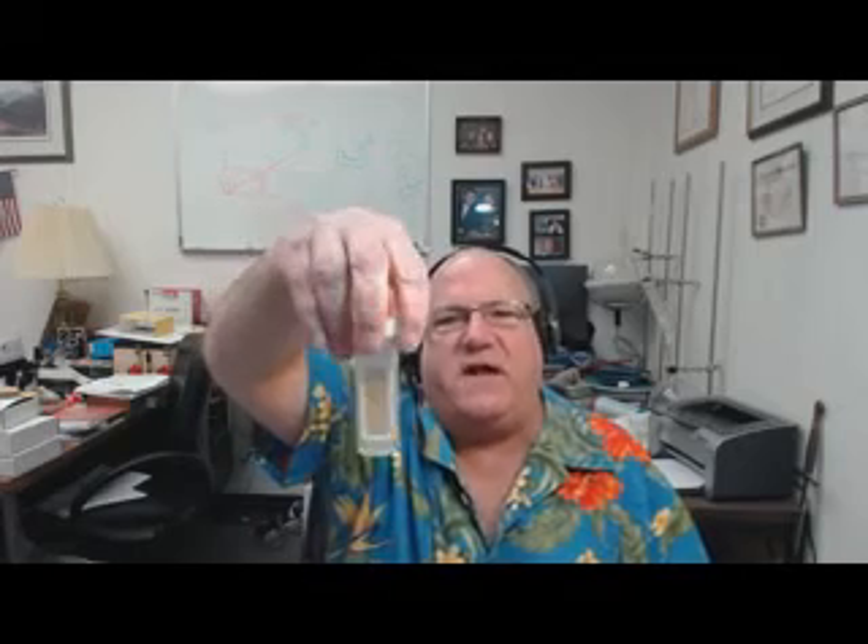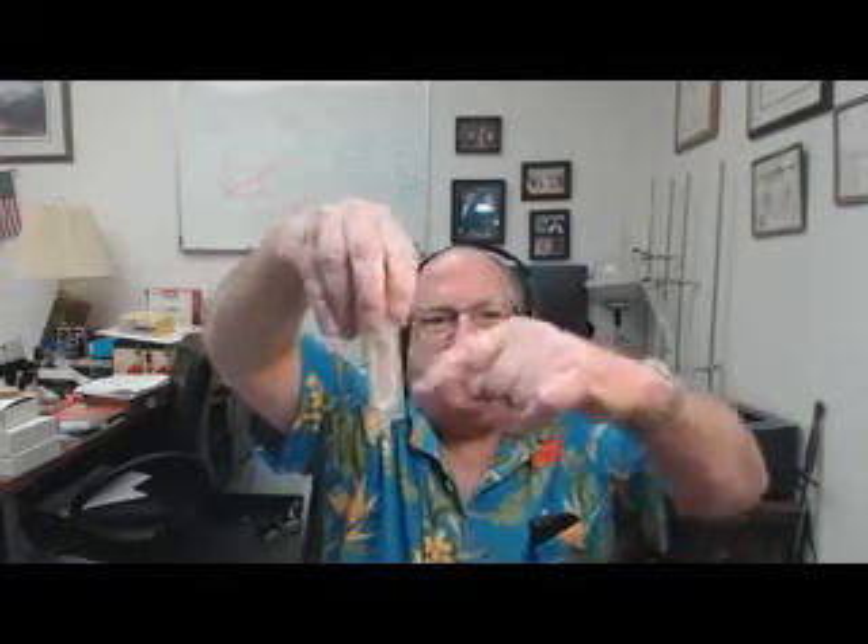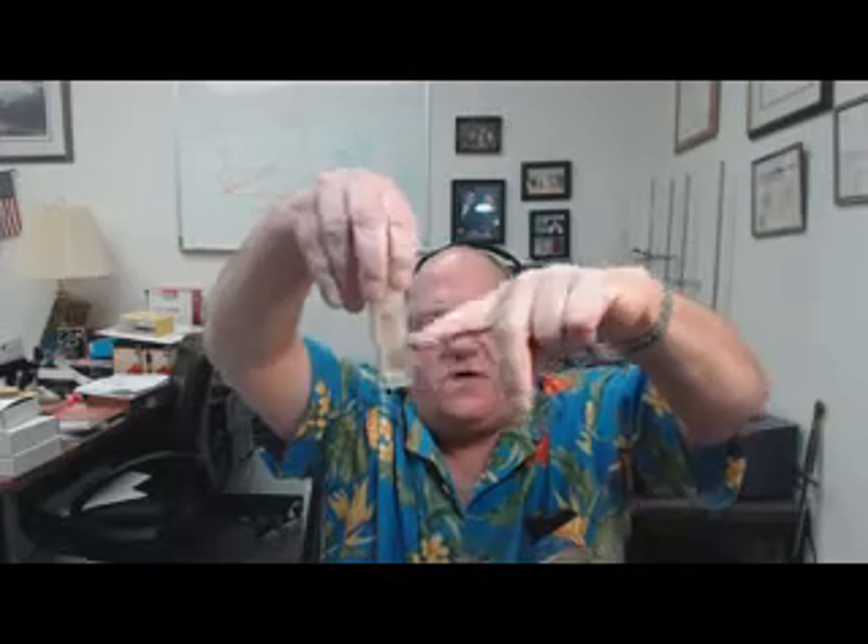Easy and inexpensive. Run this — if everything looks good, fine. If your pH is where the manufacturer says it should be, you're good there. Bacteria or fungus — I've seen shops that had zero, nothing, no bacteria, no fungus. I've seen shops where there were too many little globules to count. When you dip the test kit in like that, you're trapping individual bacterium and they all grow colonies, so that tells you how many bacteria you've got. How clean do you want your coolant? How much tramp oil and grease, how many fine particles do you want in it? Obviously the less the better, but this is an easy, simple way to test. That's it, thanks.